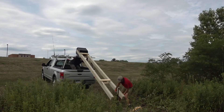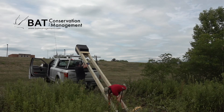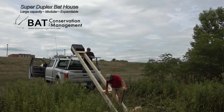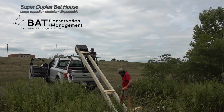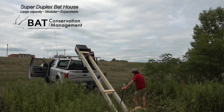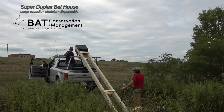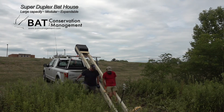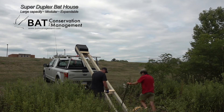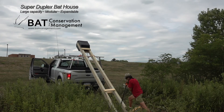Aluminum flashing is tight over the roof, really extending the life of this structure. We dug our holes 2.5 feet deep and used the truck to do the heavy lifting. A loose rope is for safety in case the super duplex starts sliding someplace we don't want it. We finish it with 3 bags of 80 lb bags of concrete, making sure to mound it up so that the base of the posts don't stay in contact with wet ground.